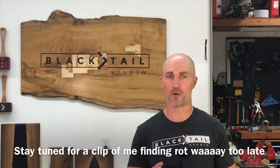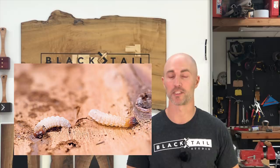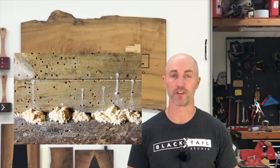The good thing is it's really not that complicated. There are a few things you need: one, is it dry? Two, is it dry everywhere — meaning are there any pockets of trapped moisture in that slab? Three, is it dried properly for your climate — if you buy it from Arizona it's not necessarily correctly dried if you live in South Carolina or Oregon, and vice versa. Once you've established you have a properly dried slab, you need to know: is there any rot, are there any soft spots? And the last thing is are there bugs — you just want those bugs to be dead.